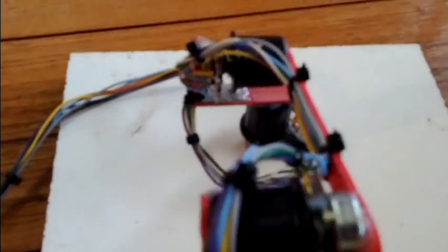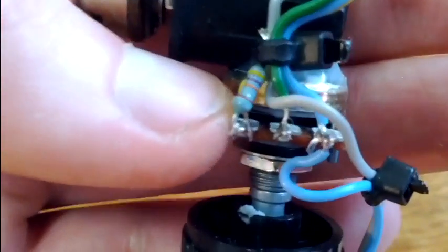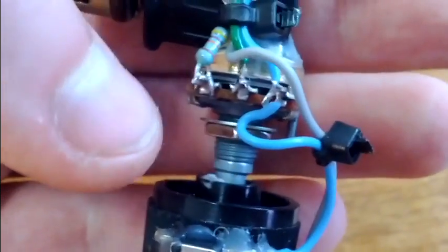There's one pot for each joint, one for the base. Those wires plug into all the analog channels. There's positive and negative, and one for that digital pin for the switch on the end. There's a resistor there — a pull-down resistor. So whenever you push the button it sends a high signal.